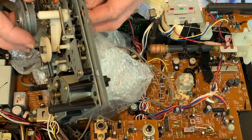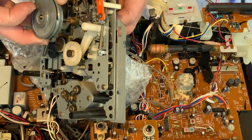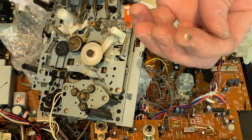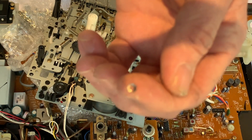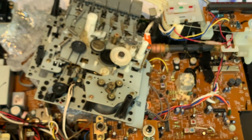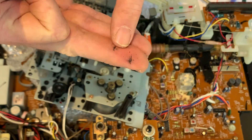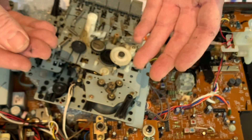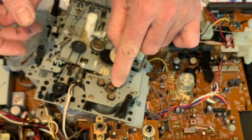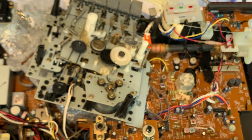I'm taking out the lever that's in the way - just be mindful of the washer on the other side of the flywheel. Okay, the flywheel is out, and there is the tiniest little washer just there, so we'll put that safe for sure. Unfortunately, I've barely touched anything and I've already got this almost indelible black stain - that's the residue of the belt and it's going to get everywhere. We're literally just going to be scraping this out gently with a plastic tool and some isopropyl alcohol to dissolve it all out, making sure all surfaces are clean before the new belt goes on.